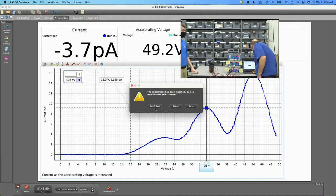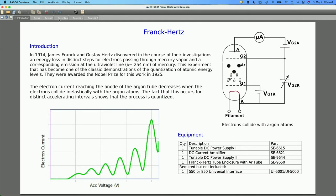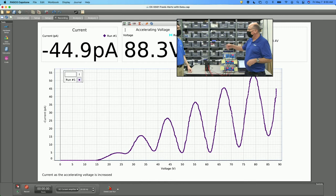Let's look at the one with data. This has the same instruction pages but with answers in the analysis and some sample data. They went a little past 85 volts — some tubes go up to 100 volts, so you want to look at the tube. There's also a word of caution in the manual: keep a close eye on the current. If it starts shooting up vertically, you should turn the voltage all the way down and turn the filament voltage down, because as time goes on the characteristics of the tube can change a little.